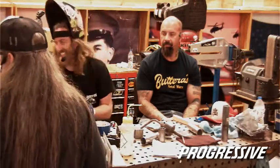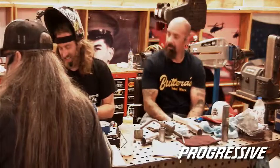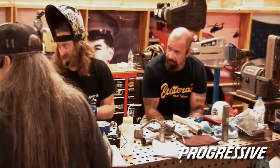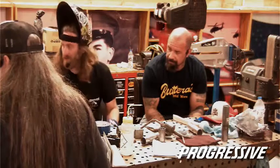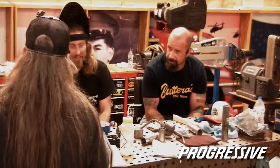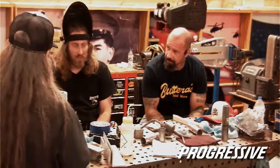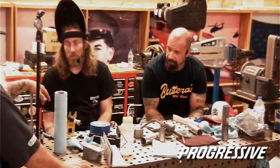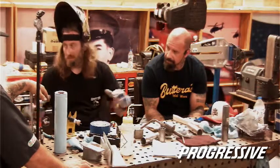Hey, real quick, Ryan Coldwater from YouTube says you could weave it at lower parameters to combat that gap. What do you say? Well, aesthetically, that's what we were talking about. It's tough to leave it low because you need the amperage there quick. The more you wait, the more it's just going to melt away.